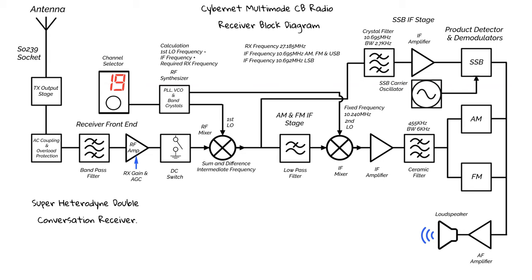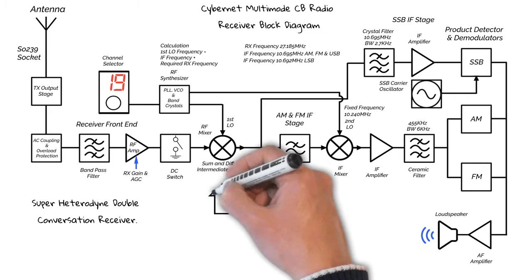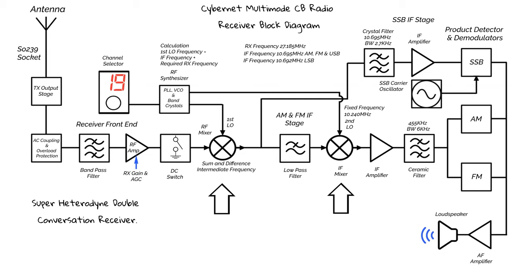Super meaning above the range of human hearing, and heterodyne or heterodyning is the action of mixing signals together. The conversion amount, i.e. double, single, triple, simply refers to the number of times the signal is mixed to an intermediate frequency. Okay, so I'm going to go through this in some detail. However, the video is indexed in the description, so you can jump ahead if you so wish.